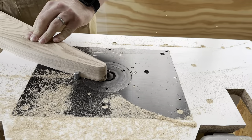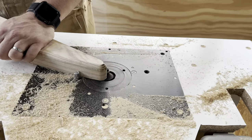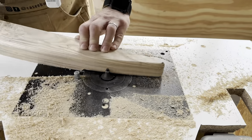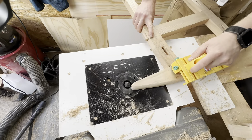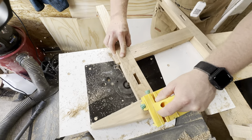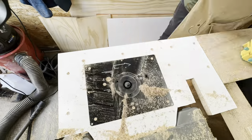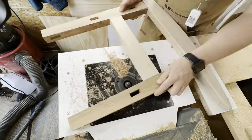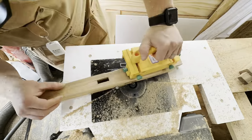So that was all the components in block shapes. What I needed to do next was start doing all the round-overs just to soften the edges of the rocker up. First I did all the rockers and then I started working on the framework just to get all the edges to flow into each other. I assembled it, and once I'd done all the corners I took it apart and then finished it off being careful not to run over the corners that I'd done.